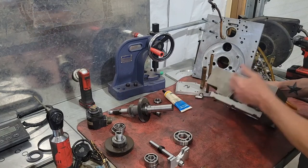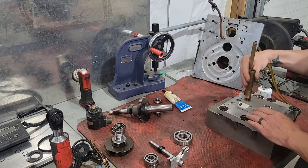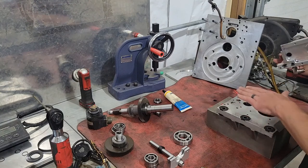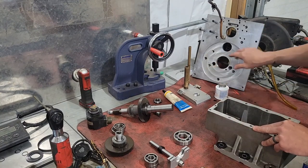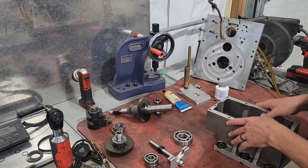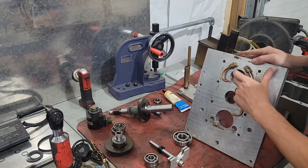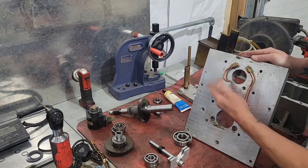Our isolators are okay — a little beat up and very grimy, just because there are no gaskets on this. What we recommend is Permatex Aviation Form-A-Gasket, part number 80019. We'll apply this evenly and torque it down on all surfaces — especially underneath and up where the motor sits. They had applied a little bit there but a lot of it was gone, which caused everything to leak out. The upper plate where the electric motor bolts on is pretty simple — receiving pockets, snap rings — and we're applying new gasket material there as well.